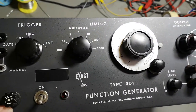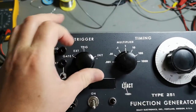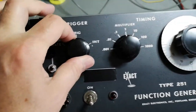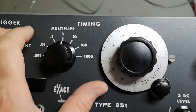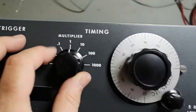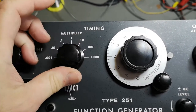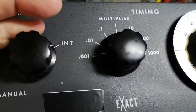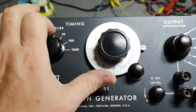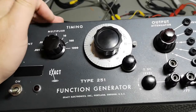It is just in mint condition. So as far as I can see, we can use internal or external trigger — how about that. This is the multiplier of the output frequency, so if we put this dial here at one, that's one cycle per second and multiplier is one, so that means one hertz. Going down: 0.1 hertz, 10 millihertz, one millihertz — really! And going up: 1000, 10,000 — so that's 10 kilohertz. One millihertz to 10 kilohertz — whoa!